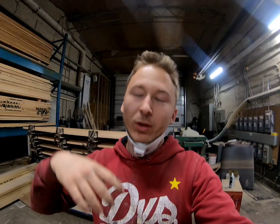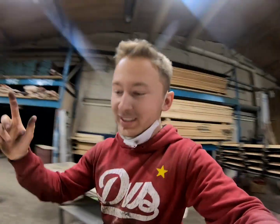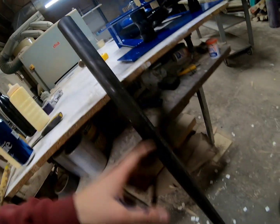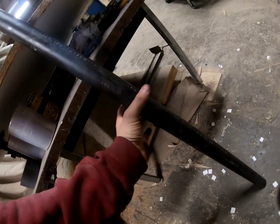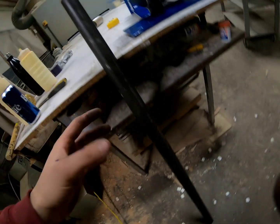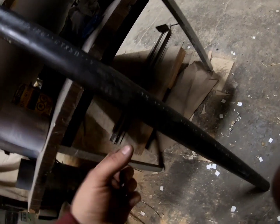The pipe is cut to length, oversized, because we don't want to do this twice. Before we put it in the machine, I've got to fill this tube with sand. Why? Because when it's full of sand and I'm bending it, the sand is basically a million rocks that move to fit what they're in. Like if you put sand in a bucket it forms to the bucket — if you put sand in this tube it's going to form to this tube. When we're bending it, it's going to stay in the shape of the tube and prevent kinking.